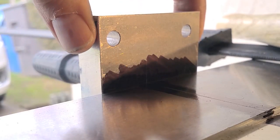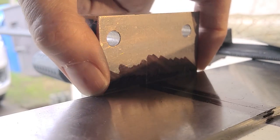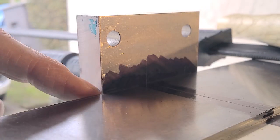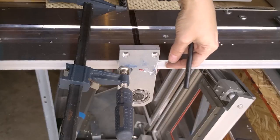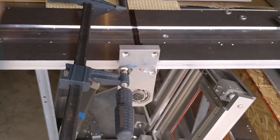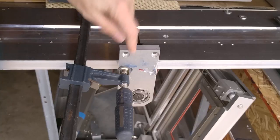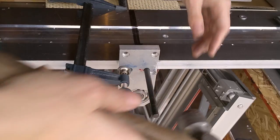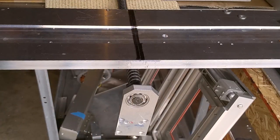This is the inside of that, the other end. I don't know if you can see it, but there's the vertical line and there's a horizontal line. I kept it proud just a little bit above, just enough so I can see it. Hypothetically, this has a radius on this edge, and it's probably just equal with it. I could scribe a line going across this way, half of the thickness, and then scribe down, measure and scribe down, but that wouldn't have taken into account the inaccuracy of how I likely drilled these holes, and I have to accept, and it's hard, that this machine is not going to have interchangeable pieces, and the harder thing to accept is that I screwed that up like that. Hopefully I can make that look a little bit better, and make sure I've got this going the right way. It's on the inside. As soon as I hit this, it's probably going to want to move, but let's see. When I get them drilled and tapped, it'll be more apparent how close they are or not.